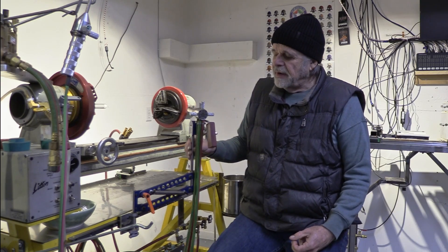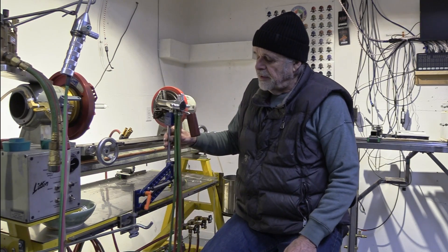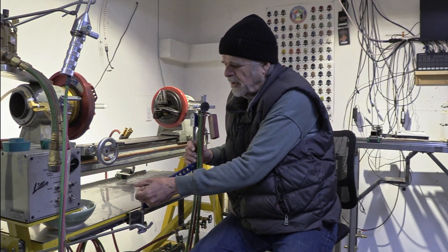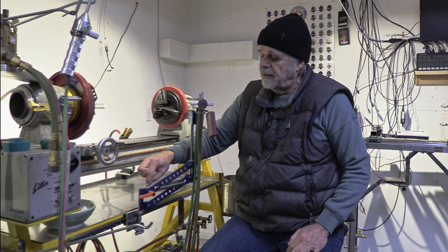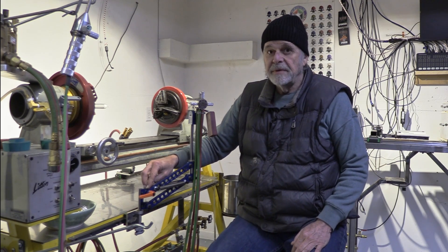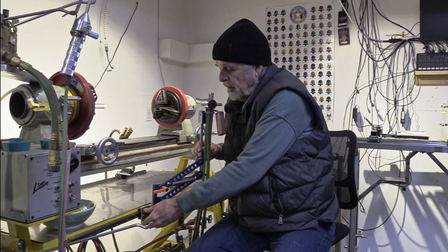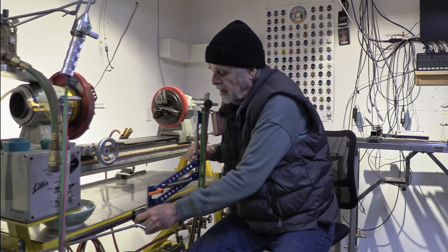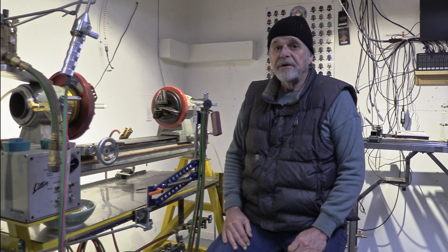Here's what I have at the moment. The little orange handle seems to work reasonably well to lock it, though I'm still figuring out the geometry — it works but it's not the most convenient. The friction material between the two aluminum parts works but may not be optimum, so I'm continuing to experiment with other materials. I've also added a knob and a piece of Delrin to be able to lock it in place along the rail, if that's ever necessary.